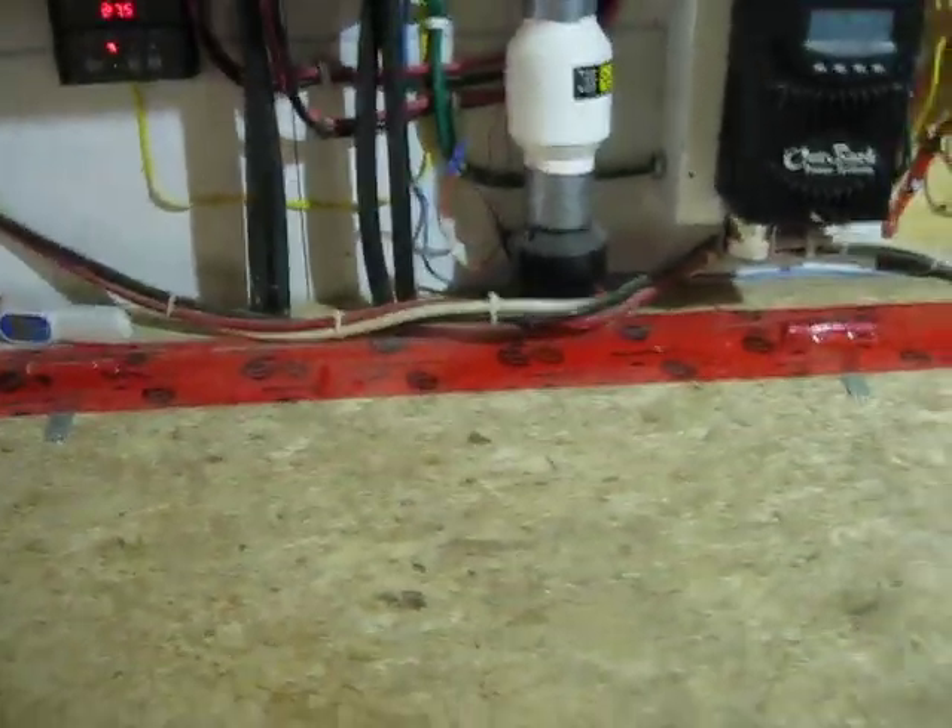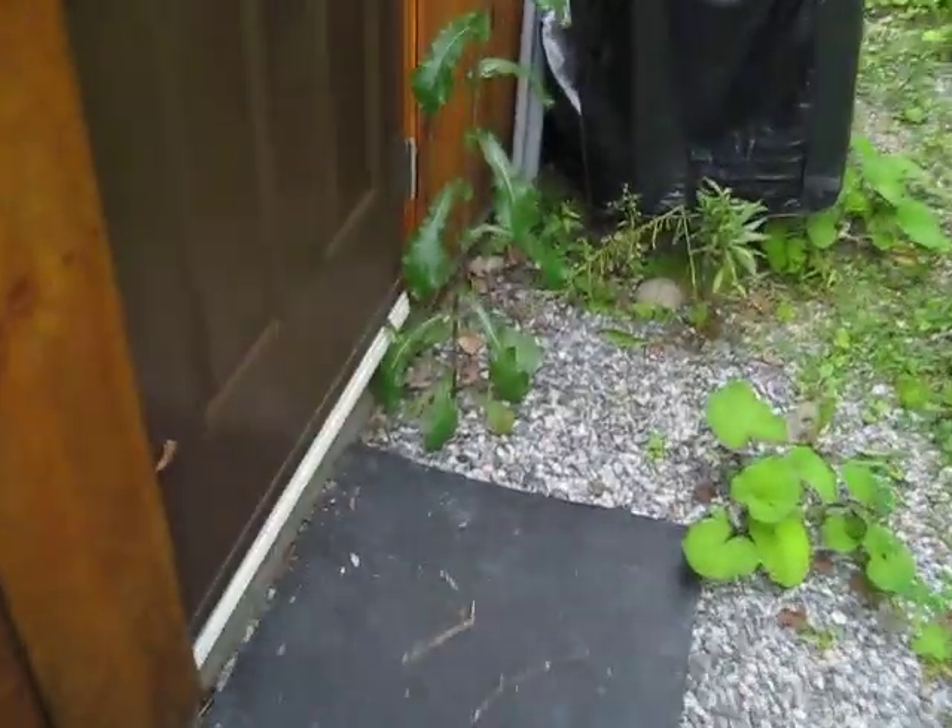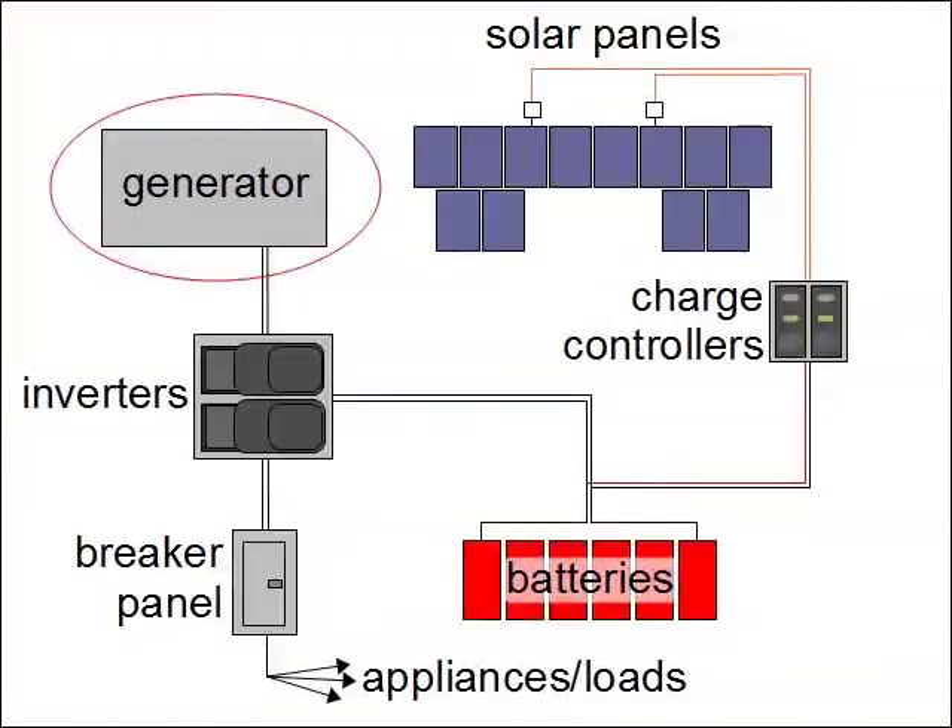The battery box has holes in the bottom for letting air in all around it, and right here is a vent with a little fan for sending the air outdoors — you can hear it right there. This is because batteries produce hydrogen and oxygen as an output, and you want to vent the hydrogen. Back here is the 10 kilowatt generator, and some of these lines make their way up and go into the wall right here, going back to the inverters where I showed you those thick cables before.